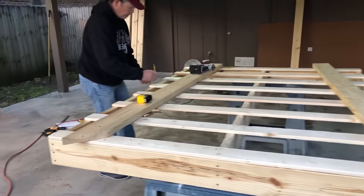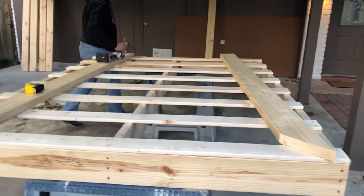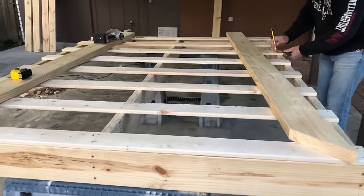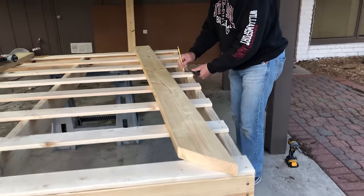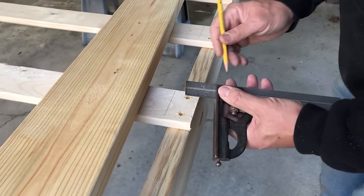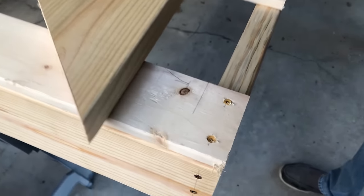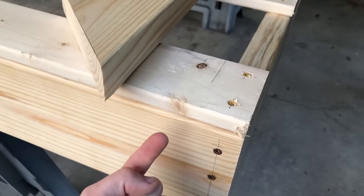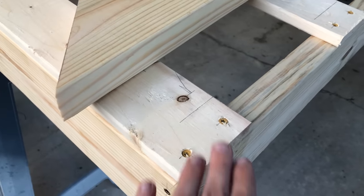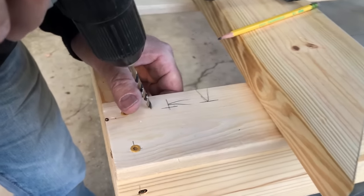We have our two sides mitered — they turned out beautifully. If you don't have a miter saw, you can use a circular saw or even a handsaw; you might not get as clean a result, but it can be done. We're marking at one and three-quarters with the combination square, which keeps us far enough from existing screws so we don't split the wood when we come up from underneath to secure the lip piece. We're going through the slat at a slight angle.